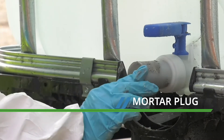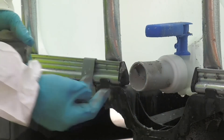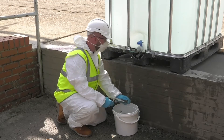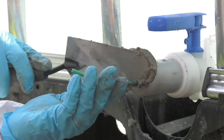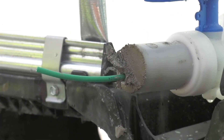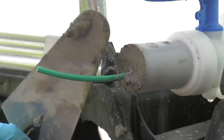If possible, leave at least 1cm clear at the mouth of the duct, or push the KB Flex 200 back to leave this space. This allows for a mortar plug to be installed — either Costa Repair Mortar Plus or Costa KB Fix 5. This final capping holds the cables firmly in position within the duct, preventing sagging which could cause gaps to form.